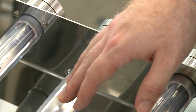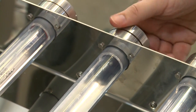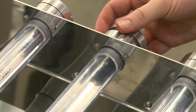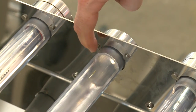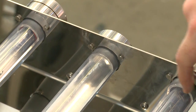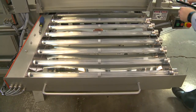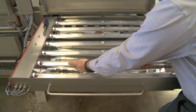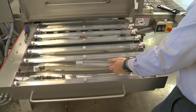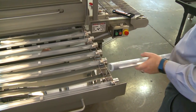To remove the outer PPC covering if it becomes damaged, or the aluminum shield if anything becomes damaged, you can replace those by first taking off the end nut. First remove that lamp and make sure it's removed. Then remove these three-quarter inch screws. When you remove the last bolt, this gland nut slides right out. The outer PPC and lamp shields come off in one piece — slowly pull it out. You can replace any damaged parts and slide it back in with the reverse procedure.